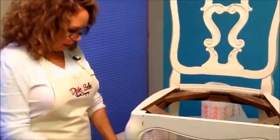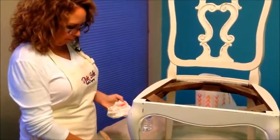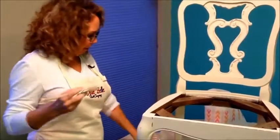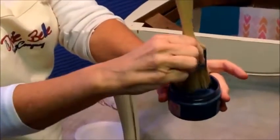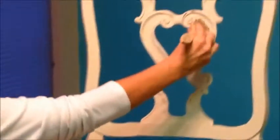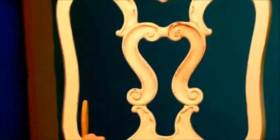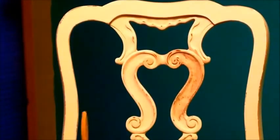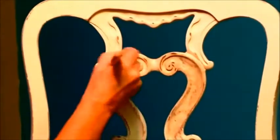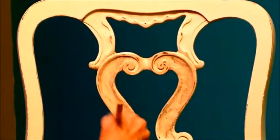I have just my regular chip brush again, and I do like my brushes damp — especially the chip brushes. They just hold paint a little bit better for me. I've got it damp, then I put it in, wipe it off, and dip it into the paint. As you can see, there's very little glaze on there — very little. And I'm going to just work in here into the corners, everywhere. I'm putting a little bit more on and working it in. You can see how it's changing the color of the paint, giving it a little more richness and a little more wear.